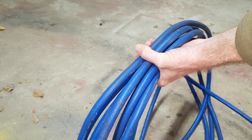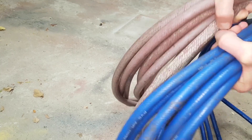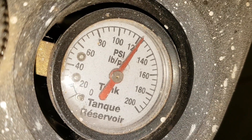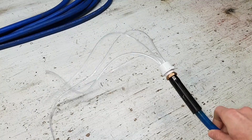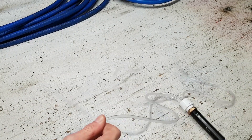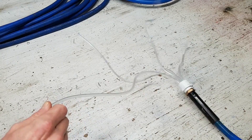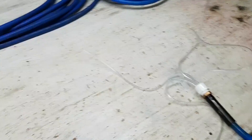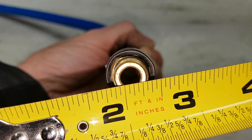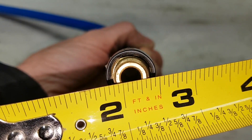Using only a single 50 foot extension hose isn't too restrictive, but adding another 50 foot forces me to raise the pressure from 100 to 120 psi to keep the whip from stalling. The quad whip needs about twice the airflow as the dual whip. My small shop hoses can't supply enough air for all four tubes, so I'll need to upgrade my compressor and the hoses before I can use the quad whip.